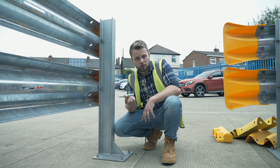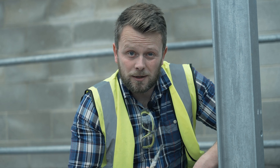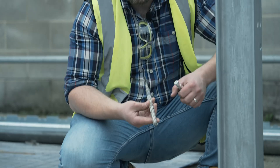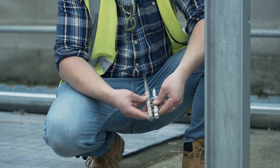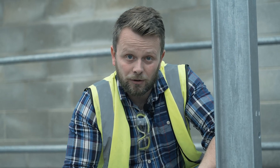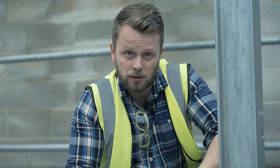I'm here to show you just how easy these are to install. The most important thing we need is a 16mm drill bit specifically for concrete or masonry. I recommend getting one that is 150 millimeters long — one inch longer than the anchor — which will allow us, should we want to disassemble the post, to hit the ground anchor further into the ground for it to be flush and disappear forever.